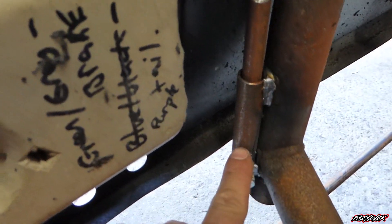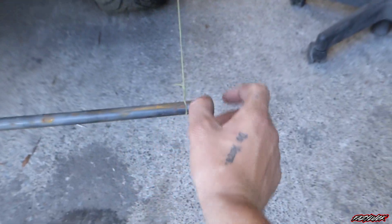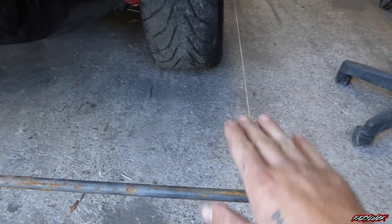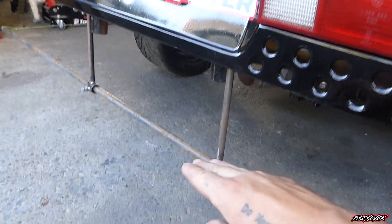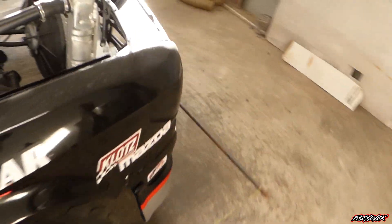At the rear I made these little tubes — hard to see on that side, I'll show you on this side — the bolt just pinches it and you slide it in and out. These two bars, front and back, have slots in them exactly the same distance apart, and I just use that to get my square. I can adjust these up and down, left and right. Same with the front — the front is a bit harder to go up and down, but still doable.